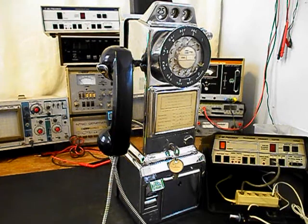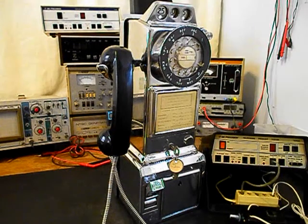We will need to relocate the network from the original conversion, and since the vault area is not going to be used, we're going to move that network into the vault area. Now, Daryl also wants a bell installed and a bell circuit, and he also wants about a foot of wire coming out with a mini switch to be able to turn the bell off and on. So we'll take care of that issue.